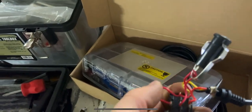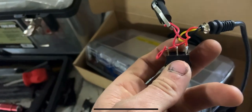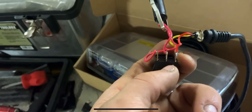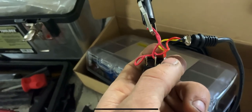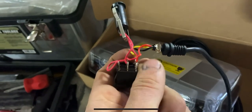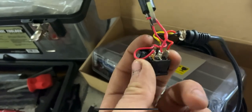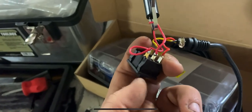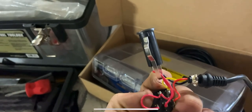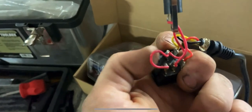This is that jumper wire for the ground right there. Because this has the lighted switch, the middle prong is going to be the power into the switch. This other one here is going to be the power out, and you can see how that wire leads up the cable and into the light — so that's how we know that one's power out. The little LED light on the switch lights up — that's what this jumper wire here is for. You can see it goes over to the ground on the ground switch to change the pattern.